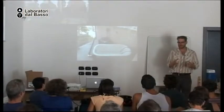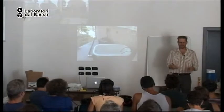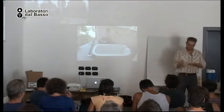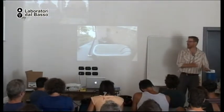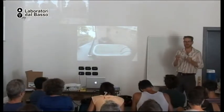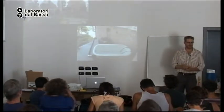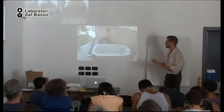not more shallow. If it's level, or worse, if it goes uphill, you will have gray water in your pipe all the time, and it will turn into black water. It will start to stink. So get it directly to the soil, where the soil microorganisms will use that gray water, and no problem.